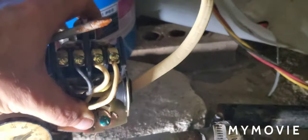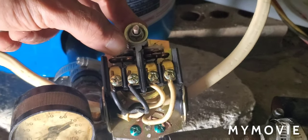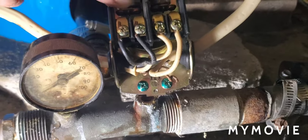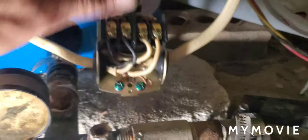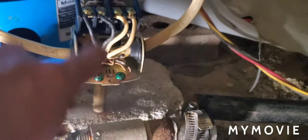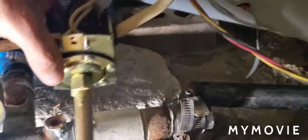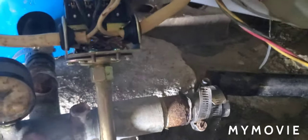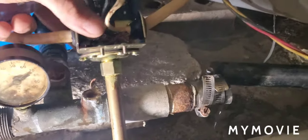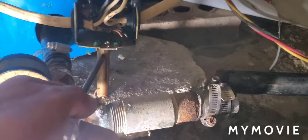If you don't have any water pressure and you come under the house, take the cover off the switch and look. If you see that the contacts are open and your gauge is on zero, then the stem is clogged and not allowing pressure to get through. The switch will be open because the diaphragm has 60 psi but out here it's zero. It can also do the opposite — plug up so much that the contacts stay closed and the pump stays on, unable to read past 60 psi.